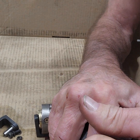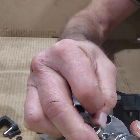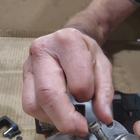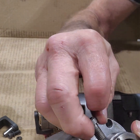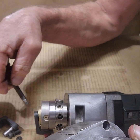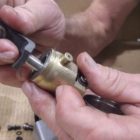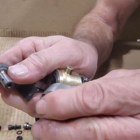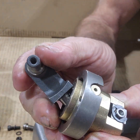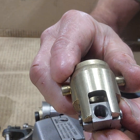I can't film it and work, so I'm just going to pop this off. When you do that, you take that off. Then you take this, unthread this bolt after you get the nut out. So that bolt comes out and then this thing will come off. There are going to be bearings inside here — this is going to be pressed into those bearings. So when you pull this unit out, you're going to have something that looks like this right here. This piece I've got right here is going to be pressed into bearings in this. On the back side of this is what the bolt threads into.